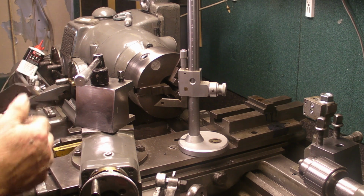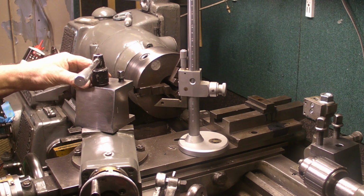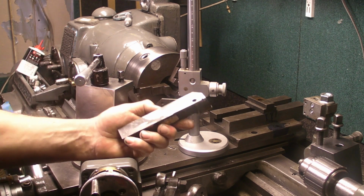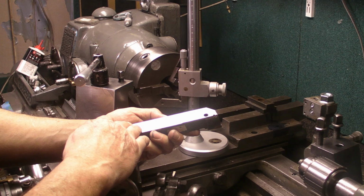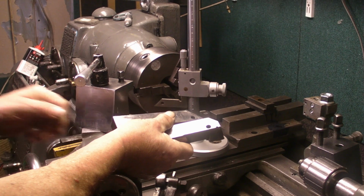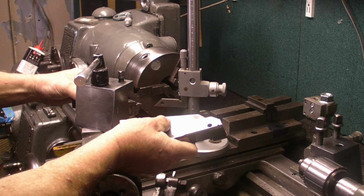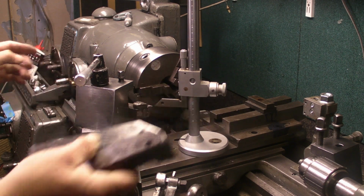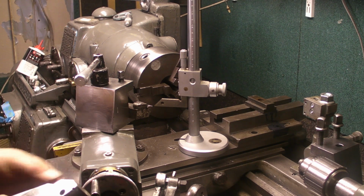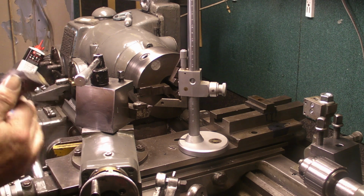So what I have been doing, this lathe is designed for 3/4-inch shank. So I've been buying the 1-inch shank ones and machining them down. Got quite a few. The most popular tools that I use I've machined down, so when they fit in the tool post, they're the correct height without having to put any shims in. And if you come to change a tool, you don't have to think, oh, is that going to be the right height? You know it is, without any shims.